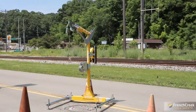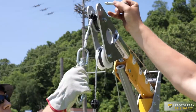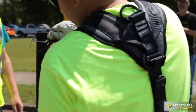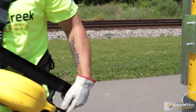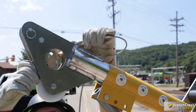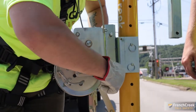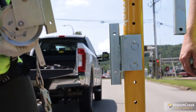Disassembly of the davit system is quick and easy. First, make sure you cover the confined space. Next, allow the rescue SRL to fully retract, then remove the locking pins from the attached bracket. The rescue SRL is now separated from the davit. The same procedure releases the material winch, except you will have to fully wind in the excess cable. Pop off the wire safety snaps, and then remove the pins from the winch mounts. With the pins out, you can now remove the mechanical winch.